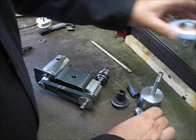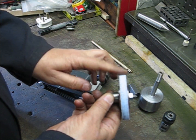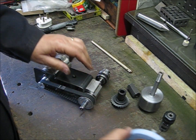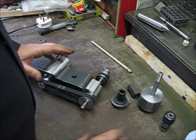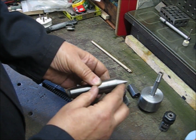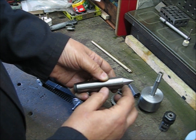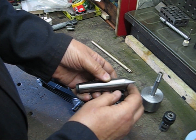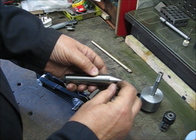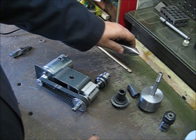Another adapter I've made is a wheel adapter. I mount the grinding wheel on there and use it for grinding bigger diameters. A couple of jobs I've used it for: I've reground a number 3 Morse taper fixed centre — these things tend to get worn and they don't stay very accurate, so I've re-dressed it so it's nice and good.